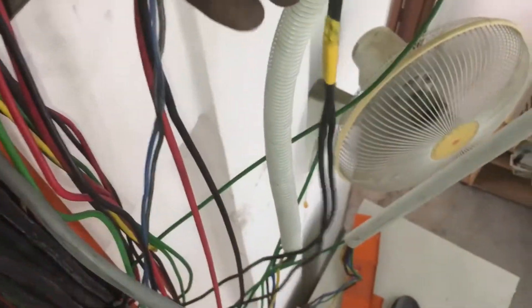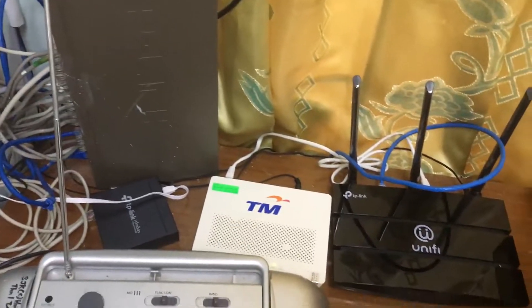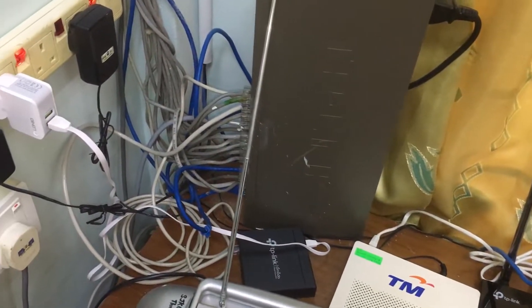Check the wires again when reaching near the three-phase distribution board to make sure these are the right ones. Use color tape to mark the wires for identification.